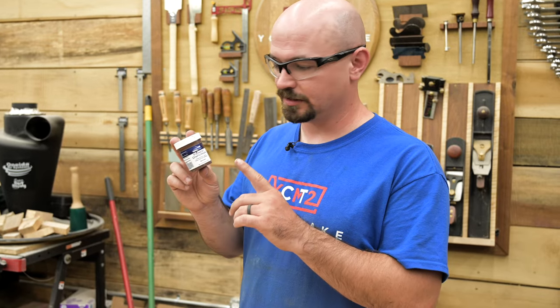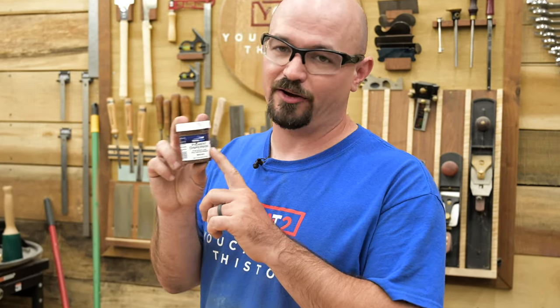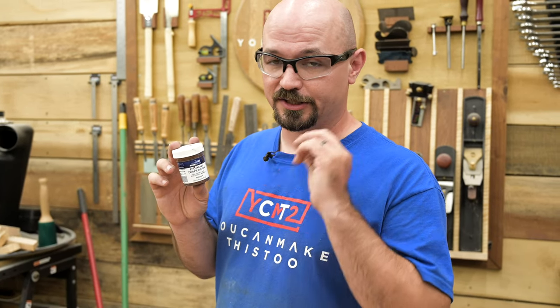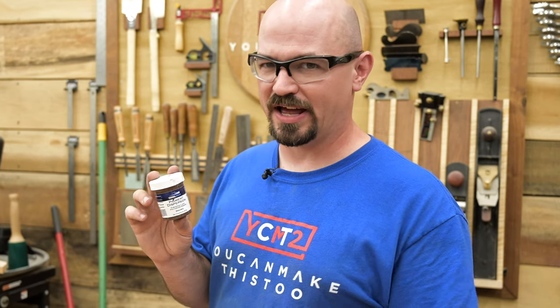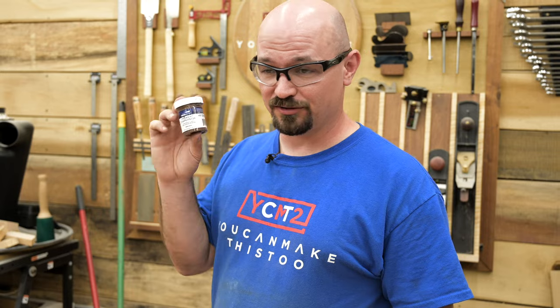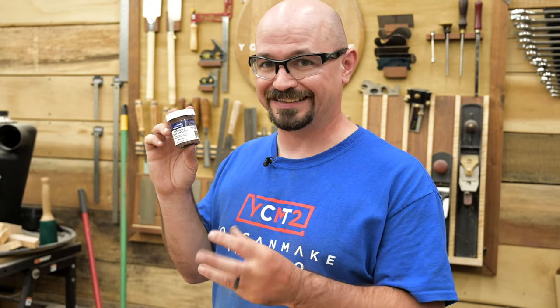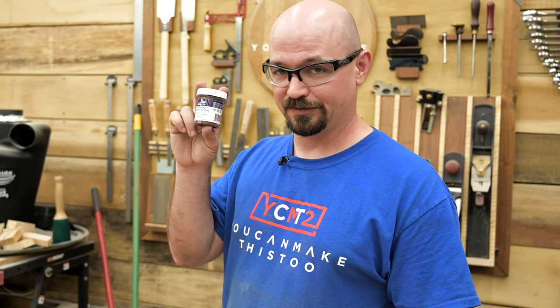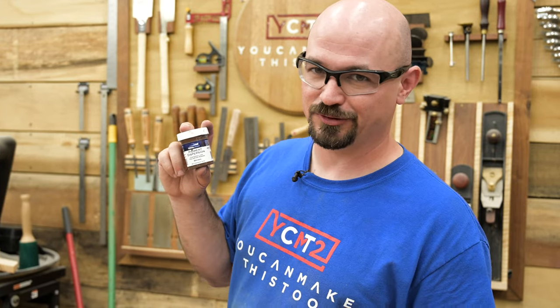On some of these glue-ups in this table, I actually had places where the board got really thin on my edge glue-up, so I filled those voids with epoxy resin and let it cure — that's going to replace the strength I'd lost in a way that epoxy putty or polyester resin just can't match. And talking about colors, especially vibrant ones — this pigment dispersion by Total Boat is great for vibrant colors like reds, yellows, blues, greens. Red can be really hard to find a good mix for sometimes, but the red and other vibrant colors in this are so rich and deep. I'll have a link below for all Total Boat stuff with a discount.